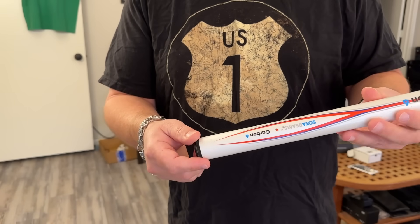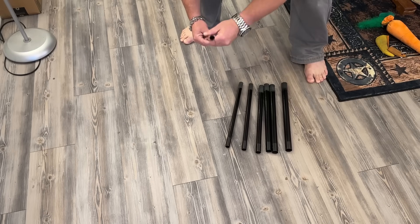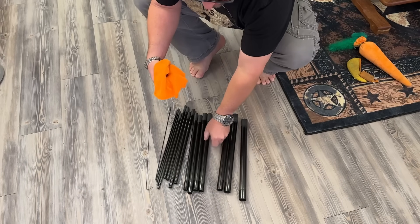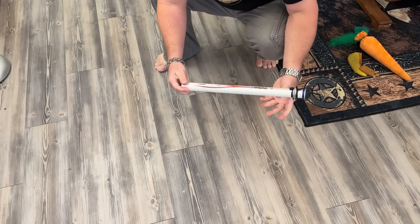Here's the carbon fiber six mast — there's a little screw connector on the bottom. You unscrew it and take out every single element. Make sure you keep them in order. Lay them on the ground, then take a paper towel or cloth and just dry them off. There's not really a good way to get inside, especially the thinner ones, so just leave it out overnight and let it air dry. Get off as much water as you can, then put it back together from smallest to biggest and you're done.